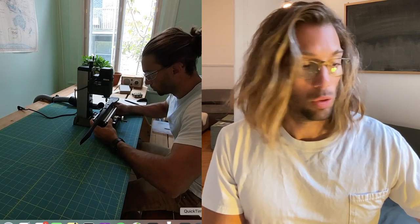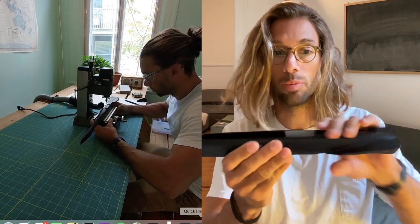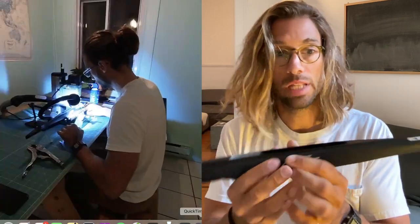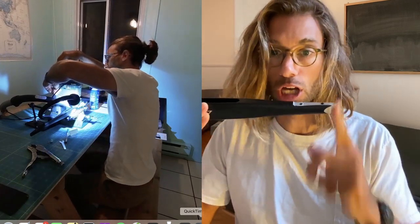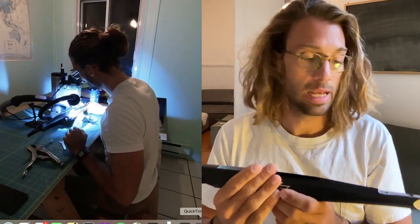Looking at how the mod was done: the first step is to remove material on the bottom in order to make a parallel surface, so that the top — the original plane — is parallel to the bottom with the mast moved forward. Then I milled the inside pocket by fixing the fuselage on the bench table, and when that was done I milled the bottom part. For attaching the rear stab, I milled that part, and when finished I tucked the part behind and sanded down the end so that it reduces drag at the tail. Then when that was done, I could ride it.